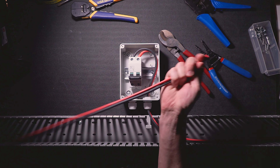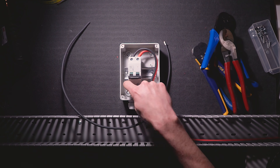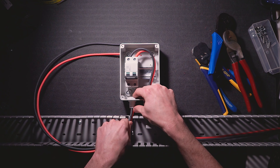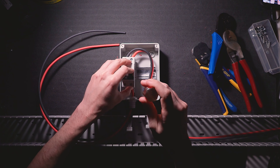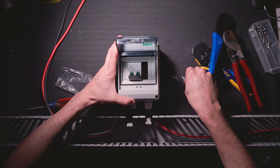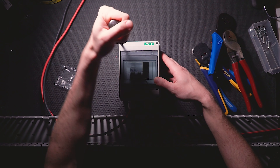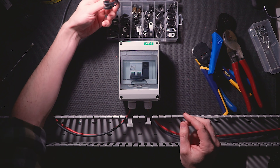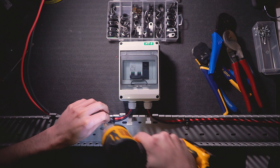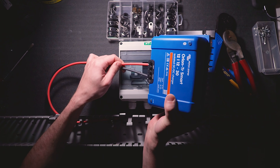This is the wire that will go from the disconnect breaker to the charge controller. This wire will be the same gauge as the wire on the other side of the disconnect, so I'm just going to use the excess I just trimmed off. I'm going to cut, strip, and put a ferrule and heat shrink on each one of these wires and insert it into the bottom of the breaker. Then I'm going to tighten up the wire entry glands and put the cover onto the enclosure with the provided screws. Next, I'm going to take my cable clamps and put them on the incoming and outgoing wires to secure them inside of the wire duct — this is a good idea regardless of whether you're using wire duct or not. The next thing to do would be to connect these wires to the solar charge controller, but that's what the next video in this series is going to be about, so be sure to subscribe.